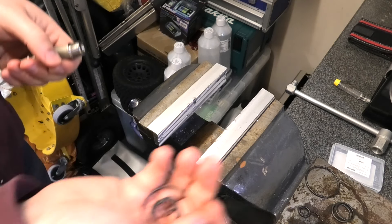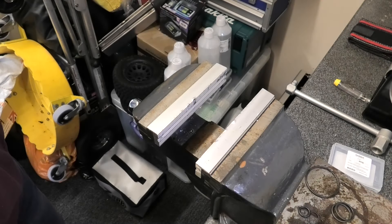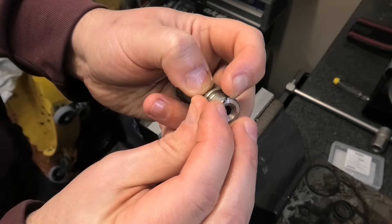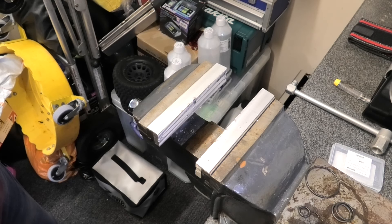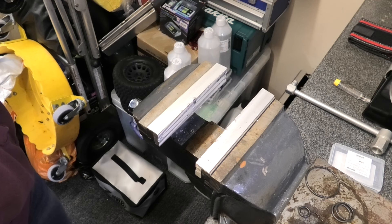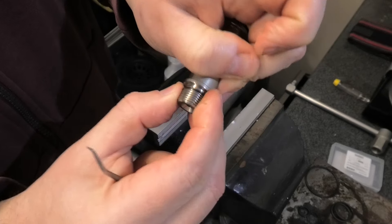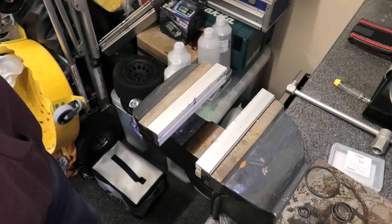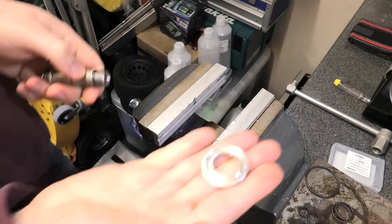Here are all the o-rings — not many. I have the internal shaft here, and we're just going to pop a new 14mm by 1mm o-ring over it. These can be quite tight, and if the threads are sharp they can rip the o-rings, so just be a little bit careful. That's the reason I bought packs of 10 — they're so thin they can split. Best thing to do is get your engineer's pick and slide it underneath the o-ring, then work it round and round and it will pop into the lower section of that shaft without any aggravation. Give it a visual check afterwards to make sure you haven't nicked it — if you do break it, just pop it off and take a new one.